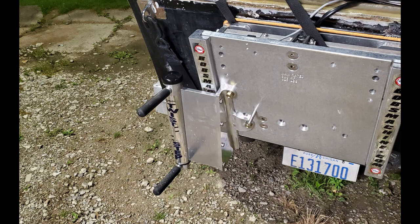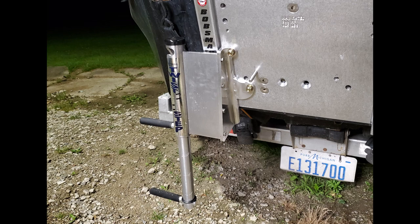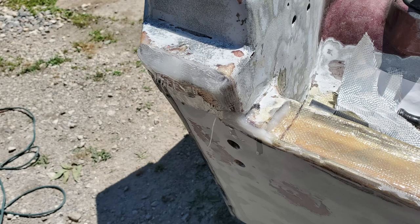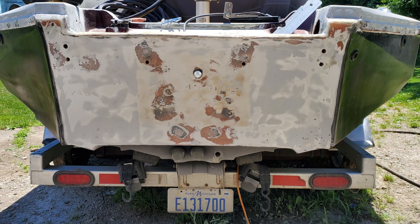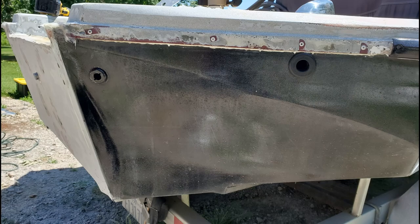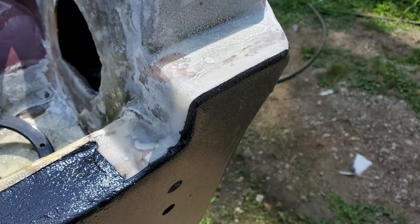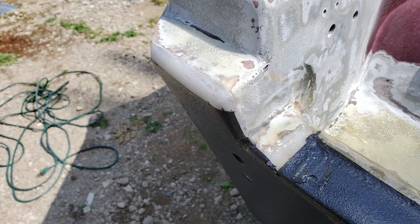Another important safety feature was attached to the jack plate — a twist step ladder that allows for easy ingress back into the boat from the water. More glass work was done at the perimeter of the transom to close up the gaps and to bond the topside shell to the hull. With all the old attachment holes filled and glassed, the entire transom was sanded and faired, and then gel-coated black to match the bottom hull. All the through-hole fittings were secured with thickened epoxy or with high-quality 3M 5200 marine sealant.